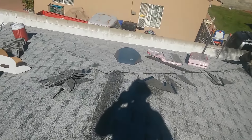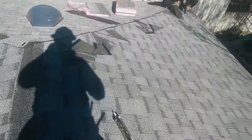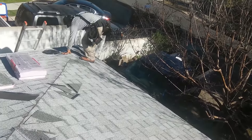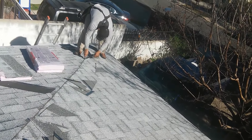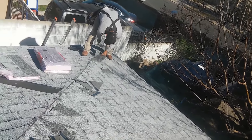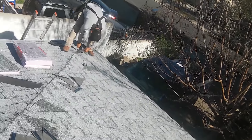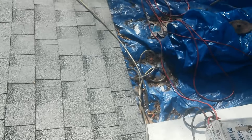These are little details that are gonna make your job look better. Even though it doesn't leak, some people pay attention to details. Those who do are gonna look at your ridge, look at your piping and stuff, and they're gonna start complaining. So take your time, cut the shingles, snap a line on the ridge and follow the line.